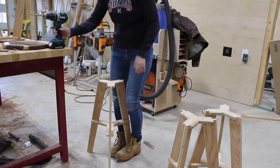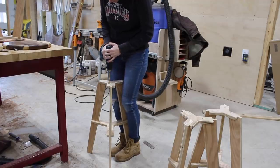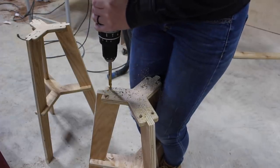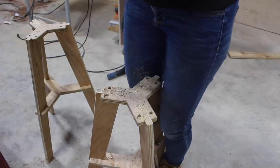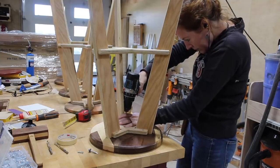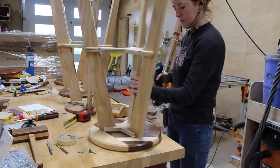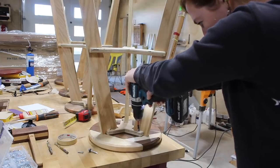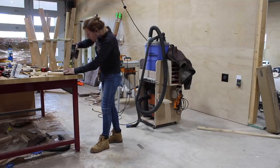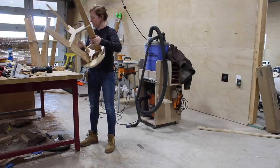With the seats being made from solid wood I don't want to just screw the base directly into it. I was planning on using Z-clips or figure-eight fasteners but a buddy suggested I drill an oversized hole through the base for the screw to pass through, then add a washer to the head. The trick is you don't want to over-tighten the screws so that the washer can't move — by only tightening down enough for the seat to be secure but allowing the washer to move freely, the seat can move if the wood does. I liked this method as it meant I didn't have to wait on ordered hardware, so I tried it out.